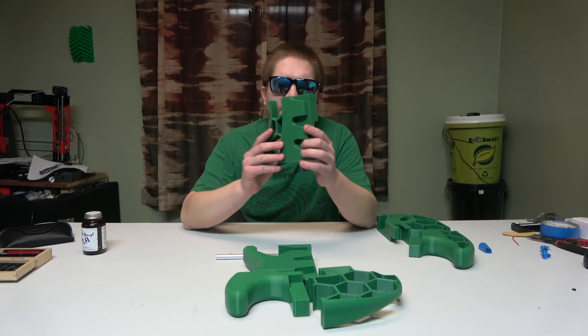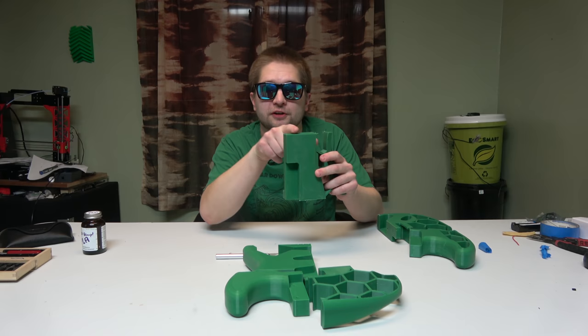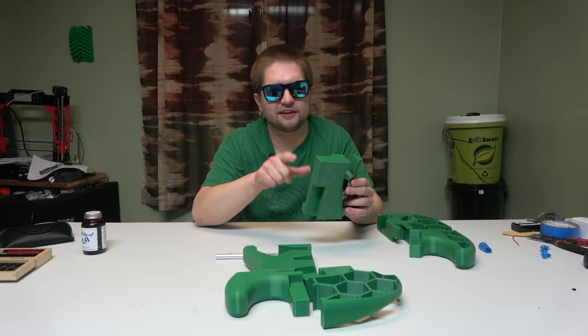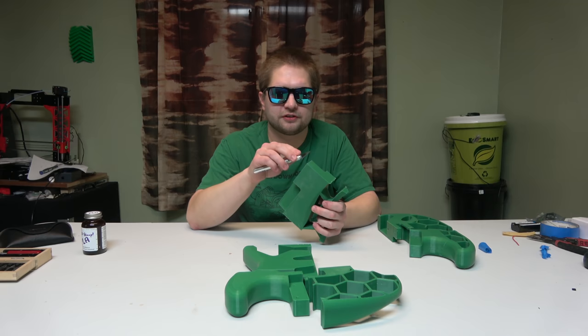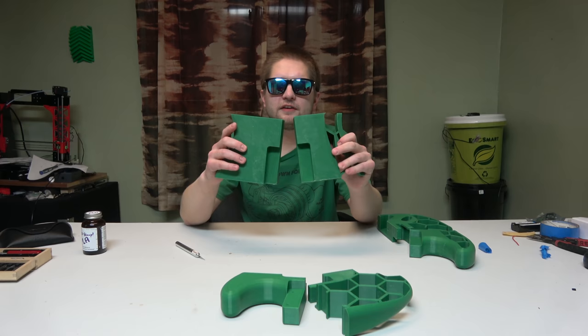There's a problem inherent to 3D printing when it comes to stuff with sharp corners. When the nozzle is coming up along this edge and it needs to turn, it's not actually possible for it to stop instantaneously. There's a likelihood it's going to overshoot the corner. So even though these are really flat edges on all the parts, there are still bumps on all of the corners — that's just really common with 3D printed stuff. I'm cleaning those up so that when I glue this together it's full contact along the whole side rather than just the edges.